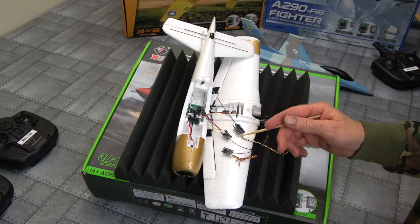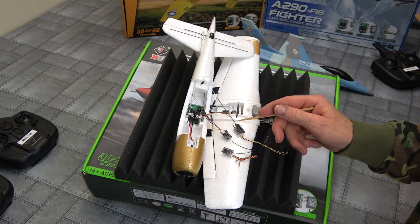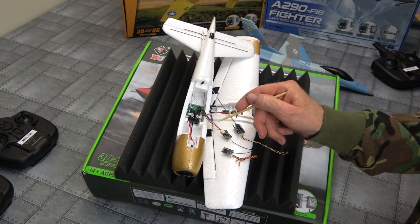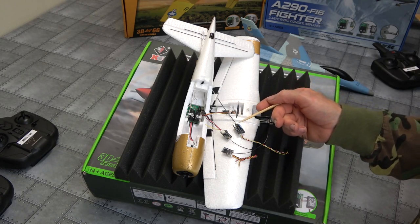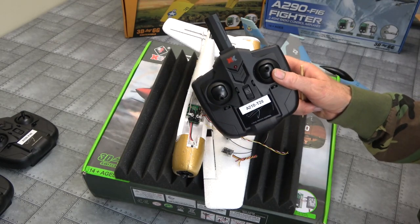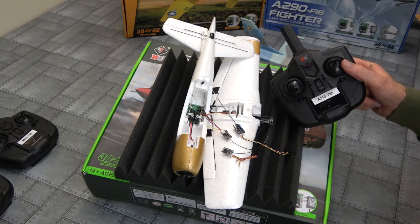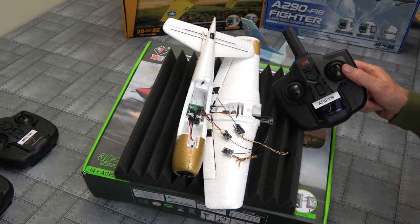I hope this helps someone. I've shown you how to wire up three different receivers — two of them wired up the same, the two FlySky receivers — and then the FrSky receiver is wired up a little bit differently. That one uses SBUS, these two use the PPM wire. I'm only a beginner but hopefully this is helpful for you. So I had to grab one of these other radios and fly the Rear Bear for you — look out for that video with the original radio. Hopefully it will fly perfect and we won't crash it. We don't like crashing our Rear Bear — it's a nice looking bird. Until then, thanks for watching!